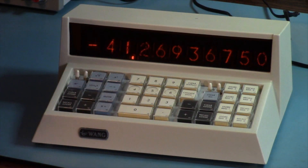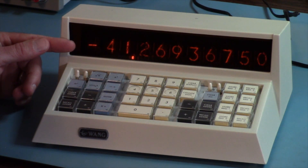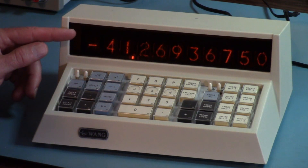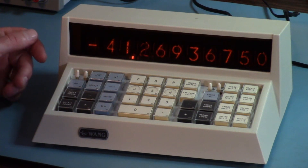Let's start with the log of 0, which mathematically is undefined. But the Wang calculator thinks the log of 0 is minus 41.269..., and I've reproduced that behavior. I'm not sure why the Wang has this particular value for the log of 0 — it's not naturally produced by the algorithm it uses for taking a log. Maybe it's hard coded; the patent doesn't talk about it. For my implementation, I hard coded it. The anti-log of minus 41 is about 1.5 times 10 to the minus 18, which is a really small number. Wang is basically using that as an approximation of 0. The largest number you can enter into the Wang is 9 nines, and if you multiply that by 1.5 times 10 to the minus 18, it's still a really small number — so any numbers you're likely to be using with the Wang and multiplying by 0 will still look on the display like they're 0.